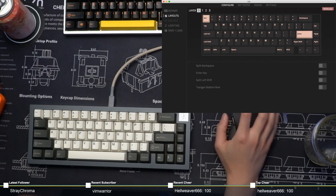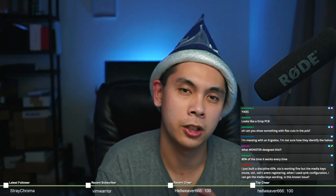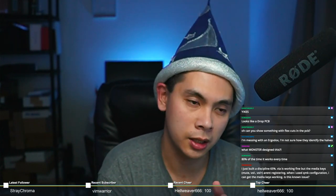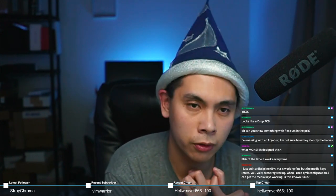But yeah, that's it. That's how long it takes to port QMK. Obviously, I've skipped quite a few steps in this process, just because I can, since the board's already put into QMK. But typically speaking, if you had a PCB with no QMK and with no Via on it, and you already know how a PCB should come together, the matrix tracing of a typical 60% should take you roughly 30 to 40 minutes.